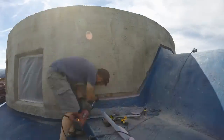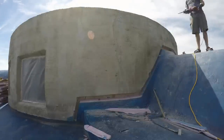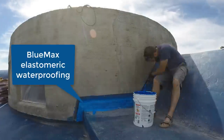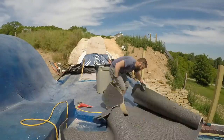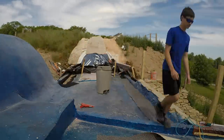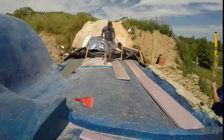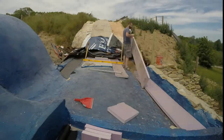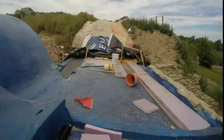You can see that gap we talked about goes under the wall but also up and over the radial vaults, and I'll need to tuck the pond liner for this roof under that wall section. But first I need to clean things up. This is BlueMax waterproofing — I've used a few thousand dollars worth on this project. All the blue you see is BlueMax painted on really thick. Over the mudroom roof we are filling that low corner with gravel. The carpet just keeps the layers separated so we don't get sand filling up any cracks. If any water gets under the insulation it can drain out. Then some sand for leveling to get that first layer right, then we start filling the gaps with insulation.